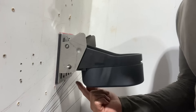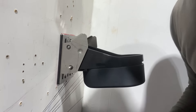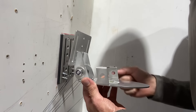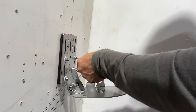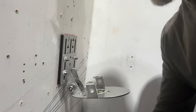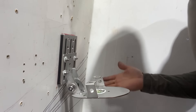The TM2 sits a whole lot closer to the transom. On the MR1 kilowatt mount, the measurement is like 60 to 70 millimeters, plus wedges — you could be adding 90 millimeters of distance — whereas you want to get that transducer as close as you can to the transom. The TM2 plate then goes on. This would be the ultimate setup because you've got excellent, easy height adjustment and also easy angle adjustment.